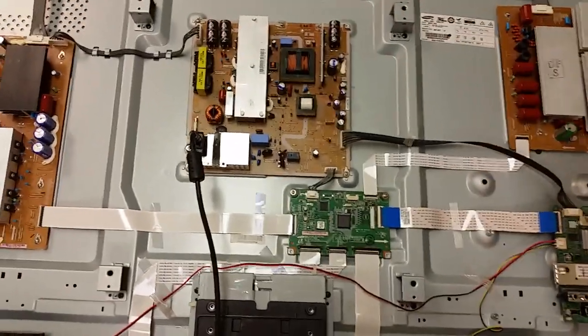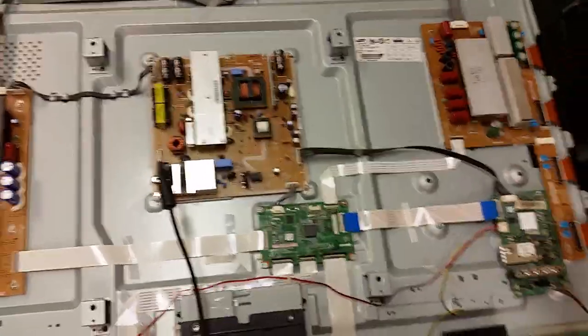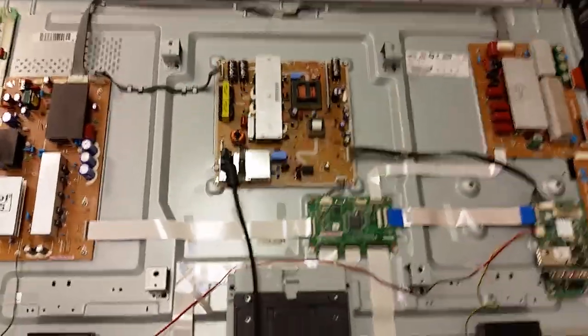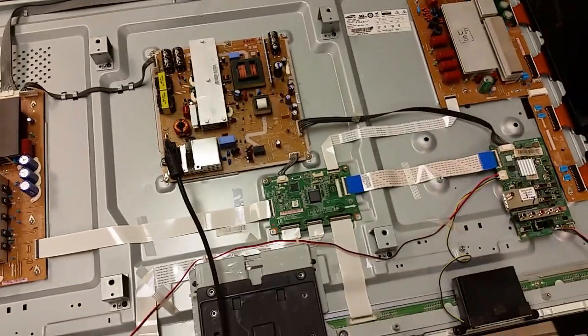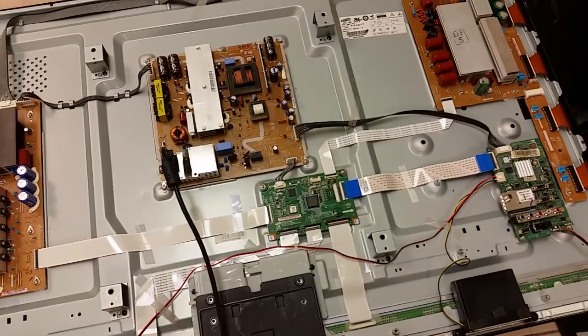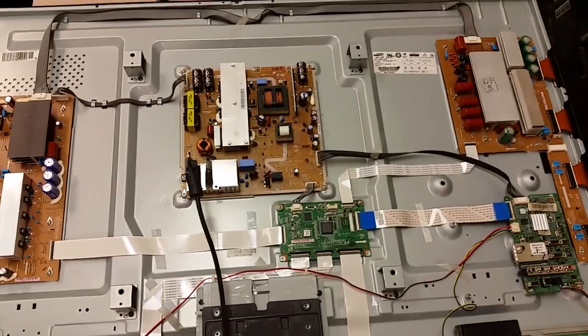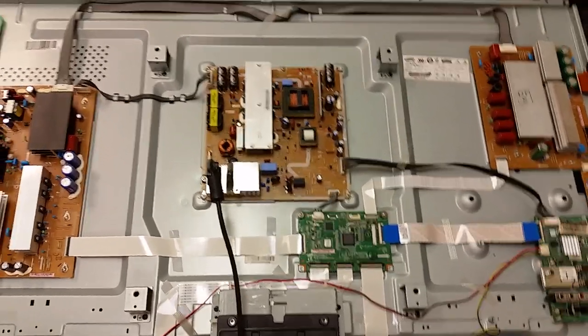And on some TVs, even the Y and the X main boards are brought together into the same board, and there are long cables going to it with plasmas. That's not so common. All this that I'm talking about, all those Y main boards, power, etc., this is something specific to the plasma TVs. It's not in any way specific for LEDs.